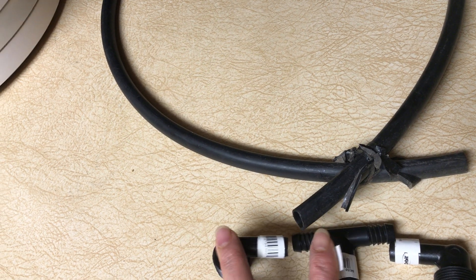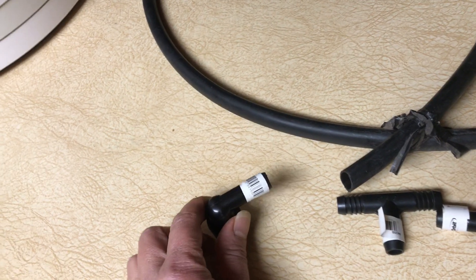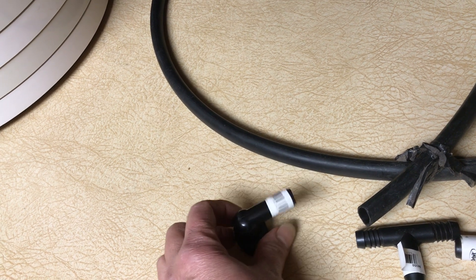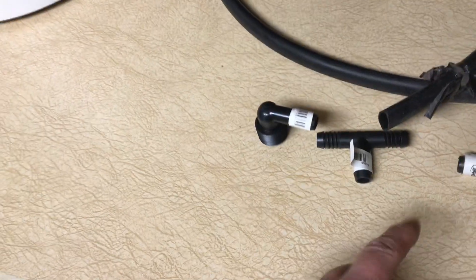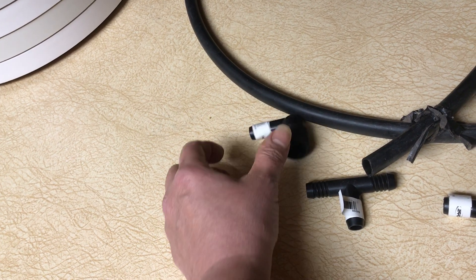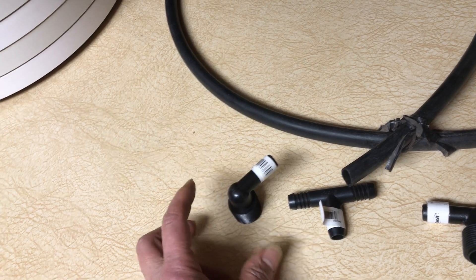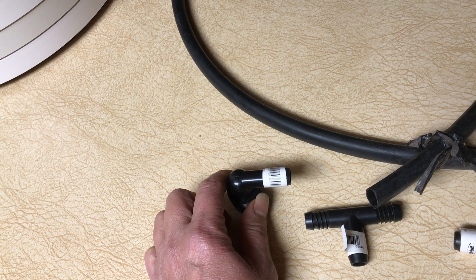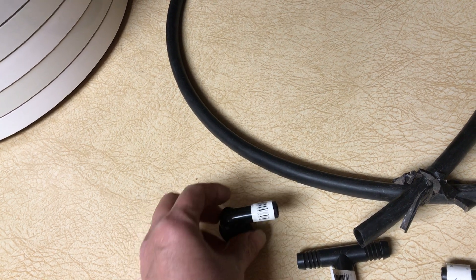Before you attach any funny pipe — before I even cut it — I cut a little section of the Rainbird pipe to attach the two pieces. But don't attach the pieces until you screw this into your PVC outlet. Because if you have the pipe already on it, you'd have to dig a huge hole to twist it around and screw it in — that is really frustrating. I've done that before and had to cut the piece off. So the very first thing you want to do is dig down to the PVC.